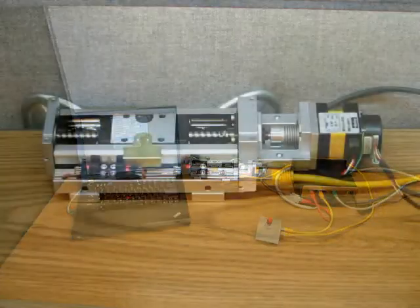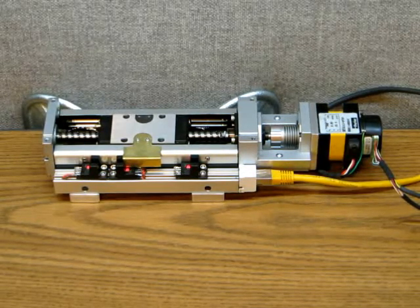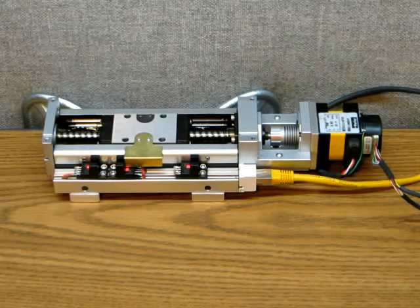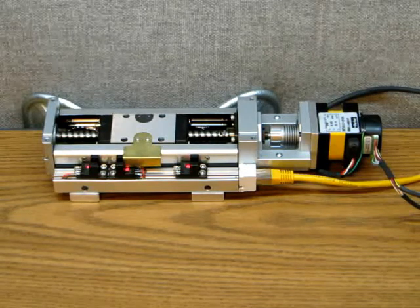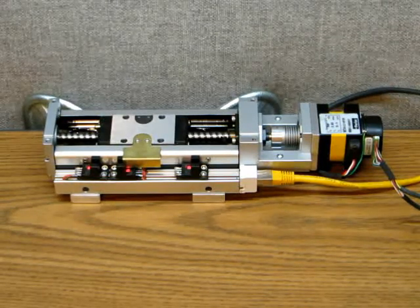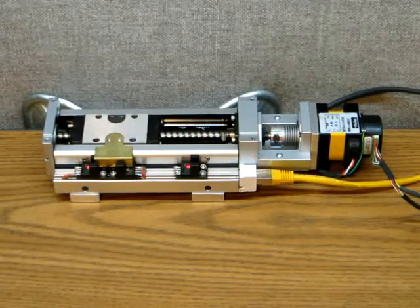We press start. The software and drive, working together, automatically stimulate the motor, extract and process data recorded by the drive, and identify and refine mathematical models. The models describe and predict the electrical, mechanical, and thermal behavior of the motor and axis. The type of the motor is automatically determined: brush, brushless, or three-phase induction. If a Hall sensor is used, its presence and commutation phase configuration is automatically determined.